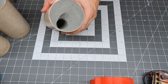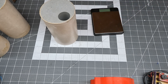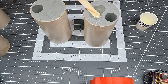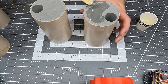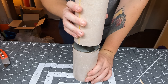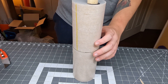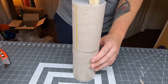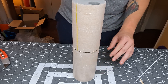On this motor the bottom grain is chamfered to make inserting the igniter a bit easier, so we ensure we start with that one and place it face down on the table — that's the nozzle end, so we don't want to glue it to anything. The Aerotech instructions say to glue the grains in pairs of two in visual alignment and allow them to cure completely before moving forward, so that's what I did. I also used a one-inch wooden dowel to align the cores before the epoxy cured, because this motor is really expensive and I don't want to mess anything up.